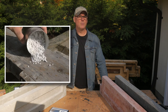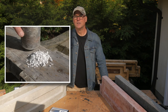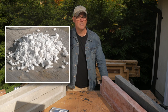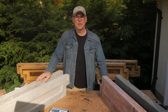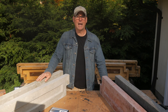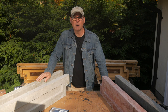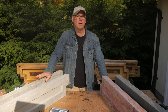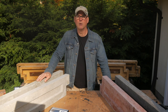Perlite is a hard, highly porous material made by superheating volcanic glass. Some viewers thought that perlite would be superior to vermiculite, as perlite does not absorb as much water. I'll show the mixing, pouring, and unmolding, then look at the weight and durability results as compared to regular gravel-based concrete. If you haven't seen Part 1 or Part 2 of this series, then you might get more from this video if you watch them first.